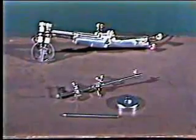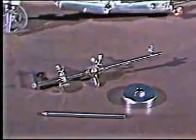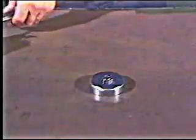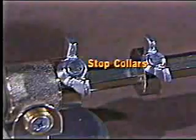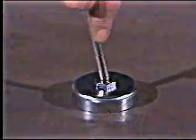The Handy Auto also has two larger optional circle-cutting attachments — one for cutting up to 20-inch diameters and another for up to 40 inches. They come with a magnet and centering point that helps you find the center of the circle, which becomes the center point on the radius rod. The radius rod is used with the standard drive wheel. Stop collars allow you to slide the torch into the cut diameter for a smooth start and stop on your cut. When you finish cutting your circle, use the center point to free the magnet.